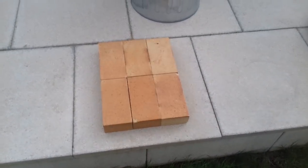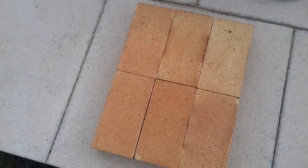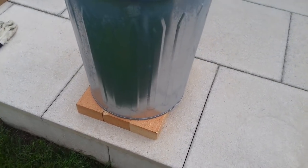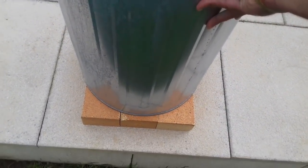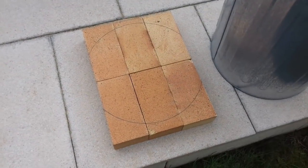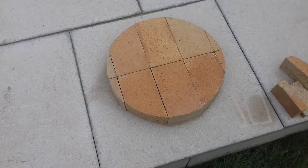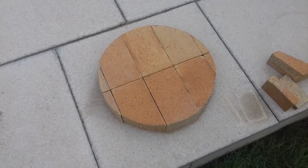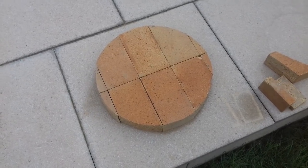The process is to create the base of fire bricks within the galvanized steel bin. I've laid them out, placed the bin on top, drawn around it, and will use the angle grinder to cut them out. That's the bin marked up on the bricks. This is the finished base now that it's been cut — not an easy task, lots of angles and fiddly bits, took a good hour or so, but we're there. As you're putting it into the bin you might need to grind it down a little bit more, but that's just as and when.